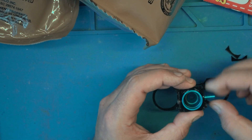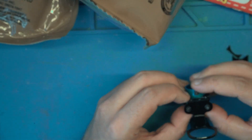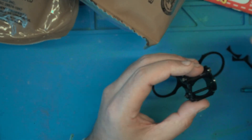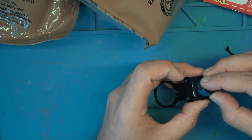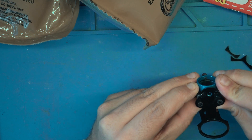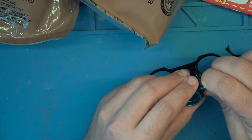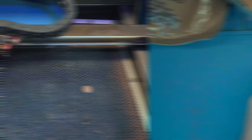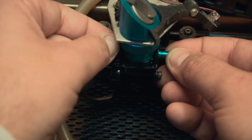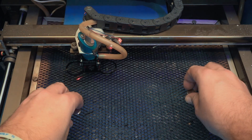Now let's take out the nozzle again — this should be free to move. Here is our finished bracket. I can simply squeeze the nozzle in here carefully, then tighten it down with the air assist nozzle. I positioned the laser head and now I can mount the bracket — just put it on, straighten it out a little bit, tighten the screw, and put on the air assist.